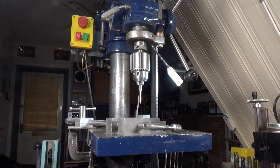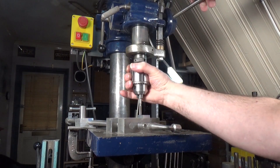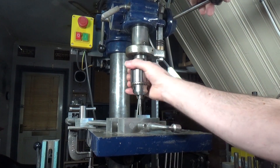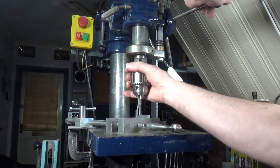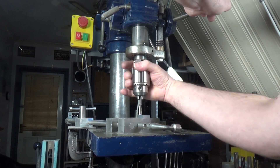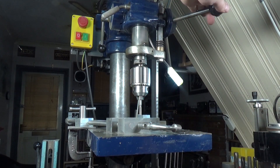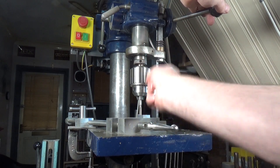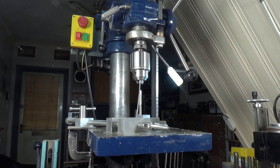Here's an easy way to tap straight holes — use your drill press. Don't use it under power. I never do power tapping; I learned my lesson with power tapping years ago. But you can start the tapping process off manually using the drill press, and that way you will definitely get a straight tapped hole. Basically all you do is push it down and start it off manually like this. Go in a few threads — not far, just enough so it's started and nice and straight. Then take your chuck key, loosen off the chuck, and go and get your tap wrench.